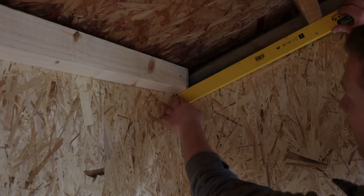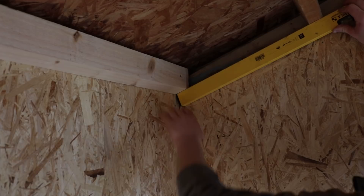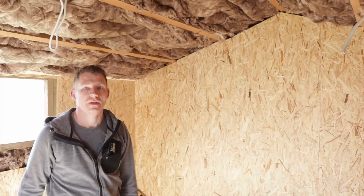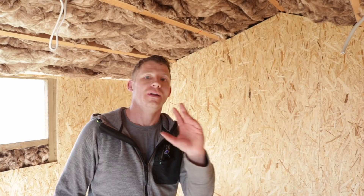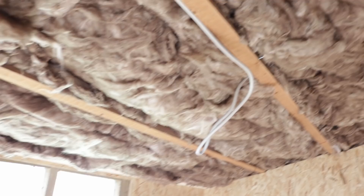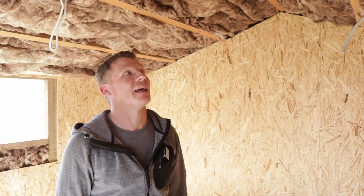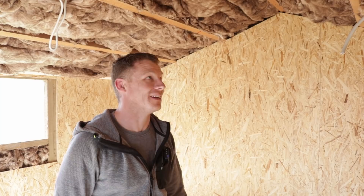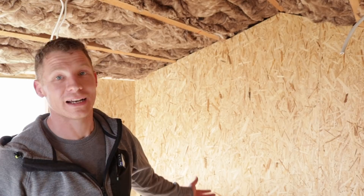Both battens are ripped and in place, which lets me run the OSB slab from the ceiling straight into the wall. I'll just run it straight in and maybe put a bead around the corner for speed. All the insulation is now in the ceiling — four-inch fiberglass again. Don't take this as how you should do your house. Fiberglass can sweat, especially when tight to the ceiling — on a flat roof it can condensate badly. But in a shed there should be no moisture source, so it should be fine, and if not I'll let you guys know.